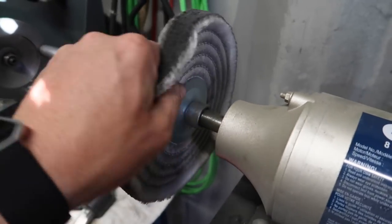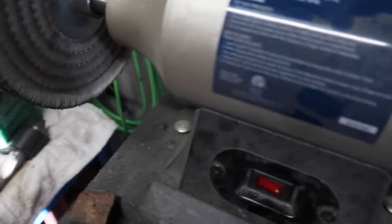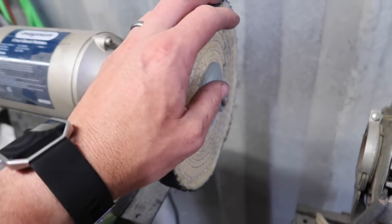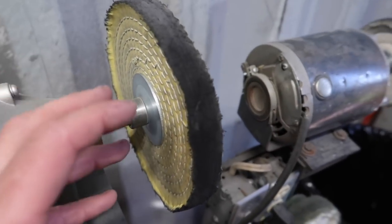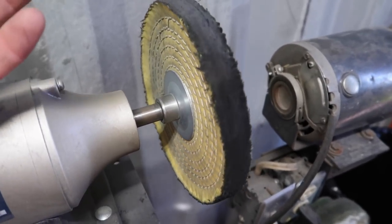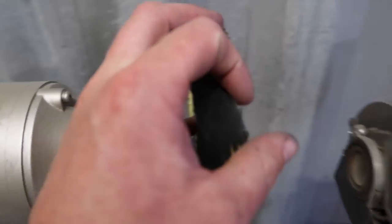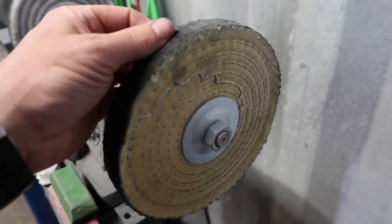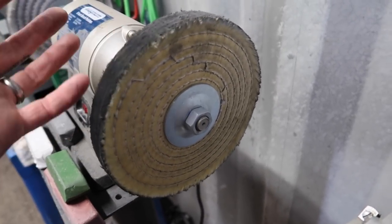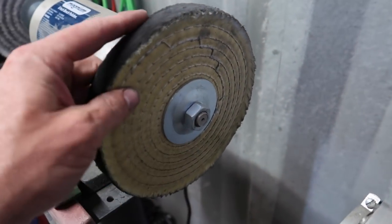On this side is just a regular cotton buff — it's much more soft and pliable than the aggressive ones. I'll use this one with white rouge. Typically I use this the most for doing a mirror polish on a bevel, to put a really nice finish on the blade. But more than that, I use this for finishing my handles. When I'm doing G10, Micarta, and synthetics, if you get down to about 400 grit and then come over here and give it a buff, this takes out any little tiny imperfections and scratches in the synthetic handle material. I've tried it on wood and it works good except that it stains it, and then you're going over it with lacquer thinner or something to clean it, and you kind of just ruin the whole point. So I don't use it with wood at all, but it works really, really good for synthetics.